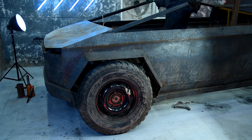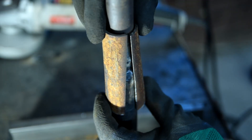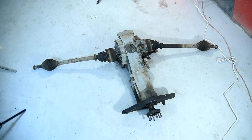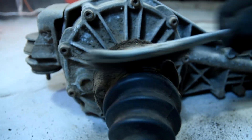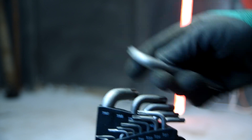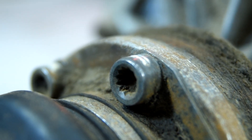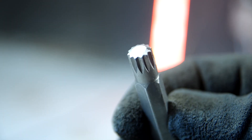Now everything is fine and the drive shafts clearly work out the suspension movement. After the test they can be welded and a split bushing native pipe can be installed — such a connection won't last long without it. The drive for the front axle is installed and we can move to the rear reduction gear. Before the installation the drives should be unscrewed. As it turned out, in order to unscrew the drives you need screwdriver bits called splines. I had to buy a special kit.